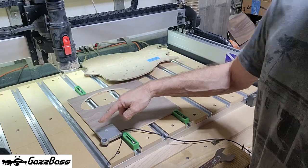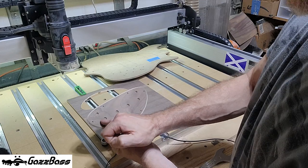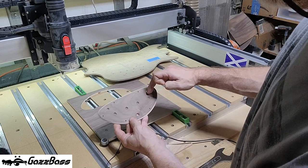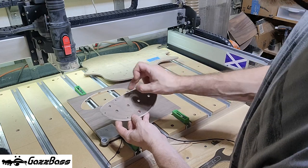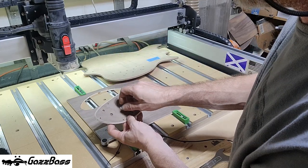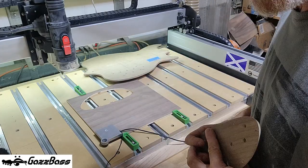And I'm going to do a design where the jack plate is going to be here, which makes much more sense. And then the controls are going to diagonally stagger up the way from the rear of the bass to the front. And the switches will be sort of here and here. So you have nice clearance, so you're not accidentally hitting a switch while you go down to adjust the EQ down there. So let's start manufacturing that, shall we?